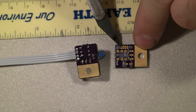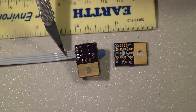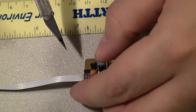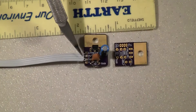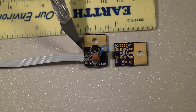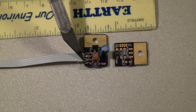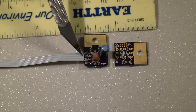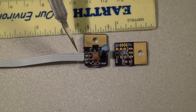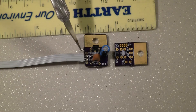The biggest thing I wanted to change were the four holes where the ribbon cable connects to the board. On the old board those through-hole pads were essentially just vias in an octagon shape. They had plenty of annular ring to solder to, which was okay, but I had to spread the leads out further than the ribbon cable spacing.